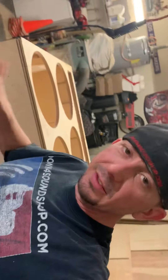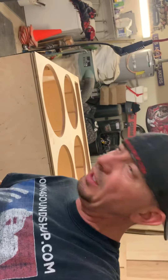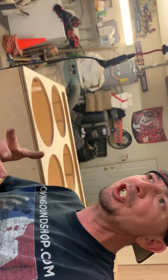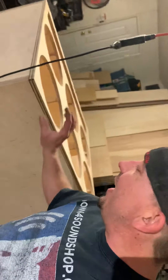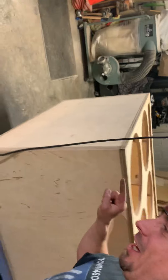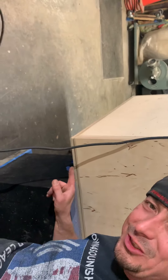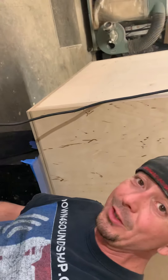The design is supposed to be 27 inches tall, with a three-layer top and a two-layer bottom. But not all material is exactly three-quarters of an inch — I'm using plywood, not MDF. MDF flexes like no other, so it's completely out. With a triple baffle, I'm losing a 16th here, a 16th there, another 16th on the bottom — that's five 16ths total, which is over a quarter inch. That's actually quite a significant distance.